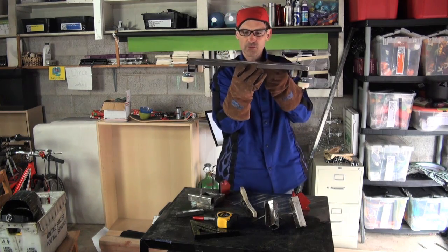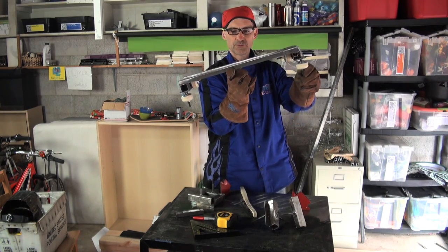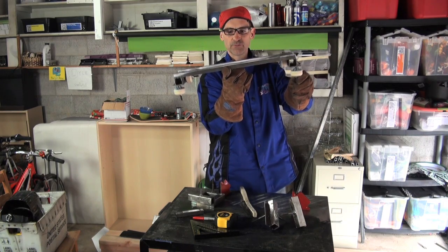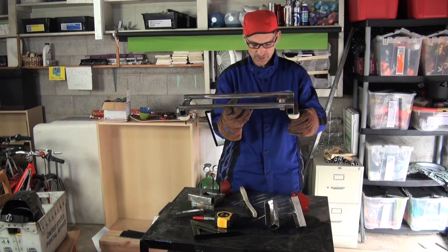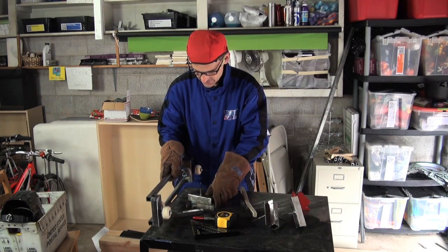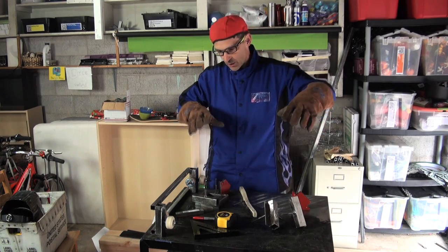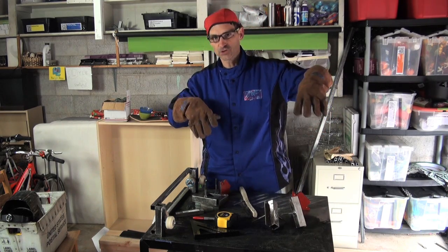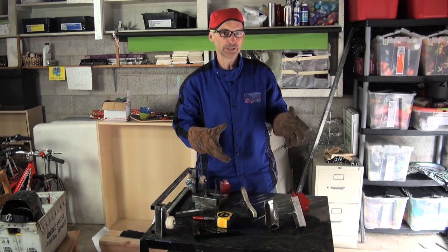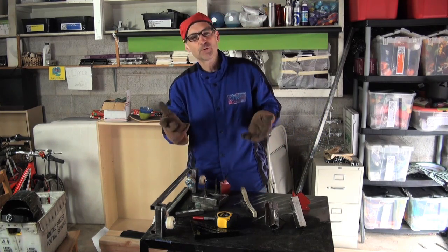The other difference between the back and the front of the cart is that the front wheels have to steer side to side and also pivot so that when the cart goes around a track the wheels can bend and turn. But the back wheels only turn. That's the way I designed the first one, because it's enough of an independent suspension for all four sets of wheels to stay on the track at the same time, and it's a simple enough design that we can build it really strong.